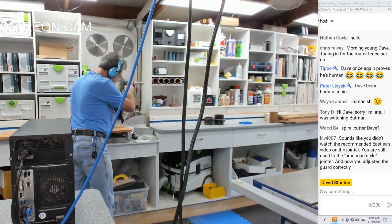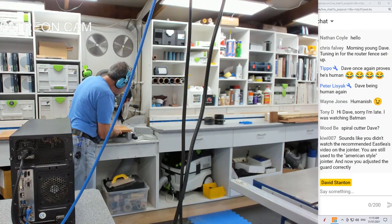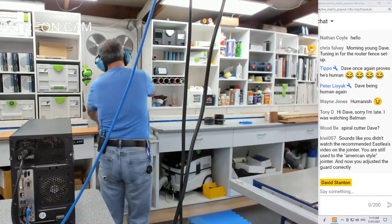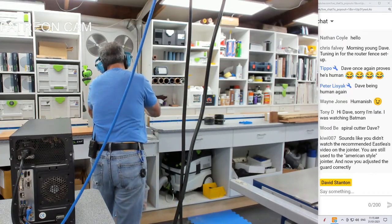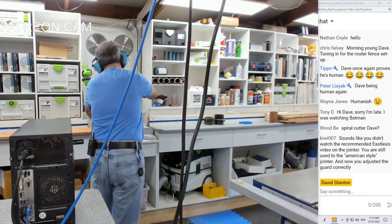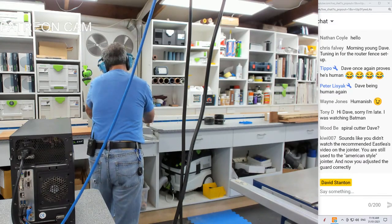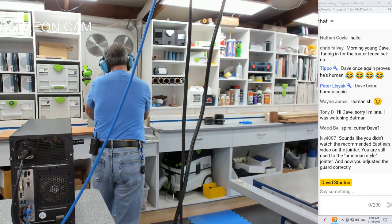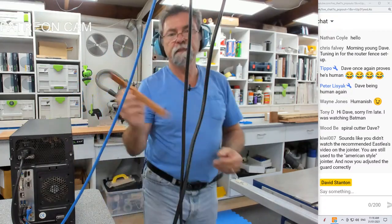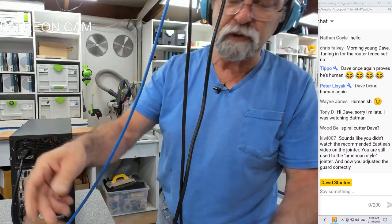I'm going to turn the lasers on so I can see exactly where it is. I've got just here, you can't see it, but I've got some rubbish there that I want to just clean off. And I don't want to lose too much of the board. So I'll do a scribe cut to start. Then back, full depth. And up. So that's in between all the cables. See, this is the part that I wanted to get rid of, which I did.